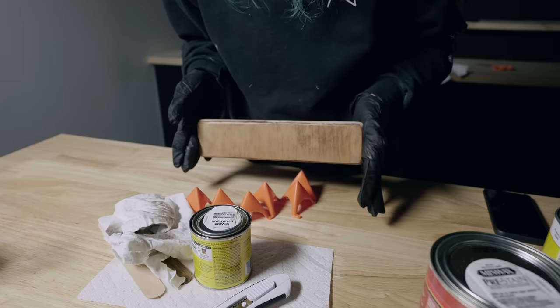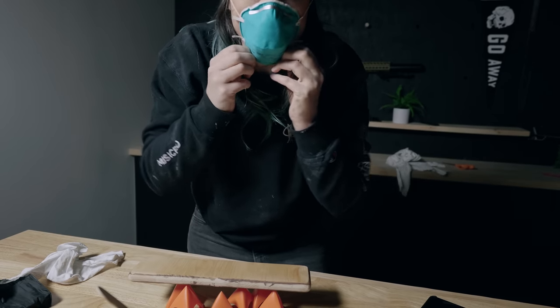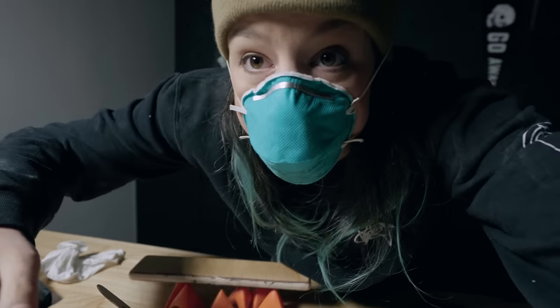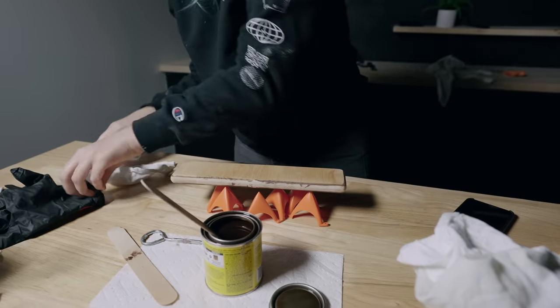We were just never happy with the color — the shade wasn't really nice and it was always blotchy. I just got stain all over the lens, I'm just gonna keep going. If you're doing stain projects with oil-based stain, make sure you don't ball up your wet rags and put them in the garbage because they can actually spontaneously combust. Lay them in a single layer somewhere safe. I actually took all those stain rags and laid them out single file on the driveway in the sun and let them dry, and then once they were cured and dried, disposed of them correctly.